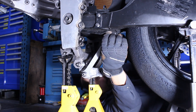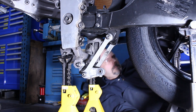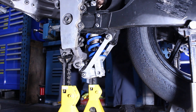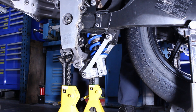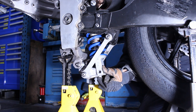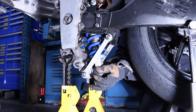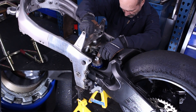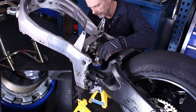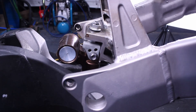The dog bones are going to be definitely the wrong length. The ZX-10 shock is shorter, and some comments say the ride will be rough, but honestly I don't think anything on a high-performance bike today will ride as rough as a 30-year-old shock. The other concern is that the shock doesn't rub on any part of the frame — I'd like to keep at least 5 mm of clearance. Why is the shock touching the swing arm? Let's switch the bracket around and see if that makes a difference.